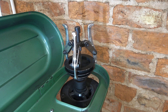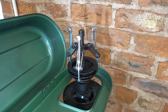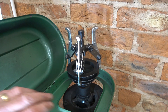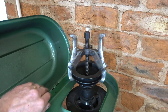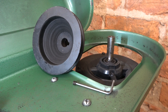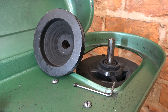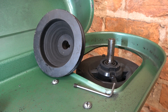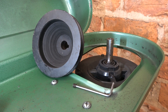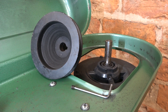One job turns into three jobs. This pulley is clunking as it goes around. I don't think it's the motor bearings — I think the pulley's a bit worn on the shaft, perhaps been running a bit loose. Anyway, it's got to come off. You can see the keyway in the pulley and on the shaft, but there's no key. And that grub screw on the end of the allen key doesn't actually fit in that slot on the motor shaft — so it's deformed it. That's why we were getting that clunking, because the pulley doesn't sit right. So now I need to find a key.